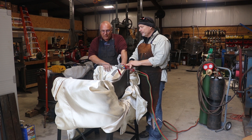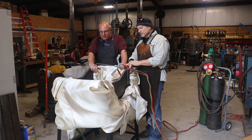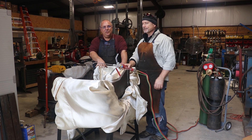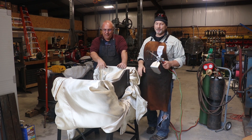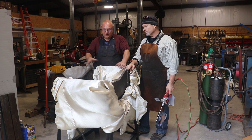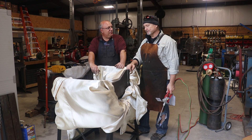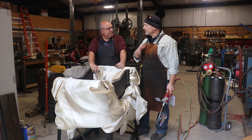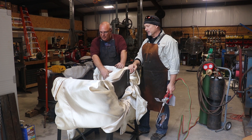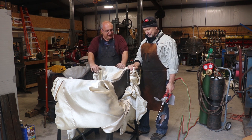So let's get in here. First thing we're going to have to do — I'm going to probably shut the camera off — but we just have to get a lot of heat into this. We're going to get a big rosebud tip on here and it'll probably take us 15, 20 minutes, maybe even longer. This is such a big casting to get it up to temperature before we can really start this welding process. We put a reasonable amount of insulation around it — we're going to try to keep as much heat in it. These welding blankets are just trying to hold everything in there together.